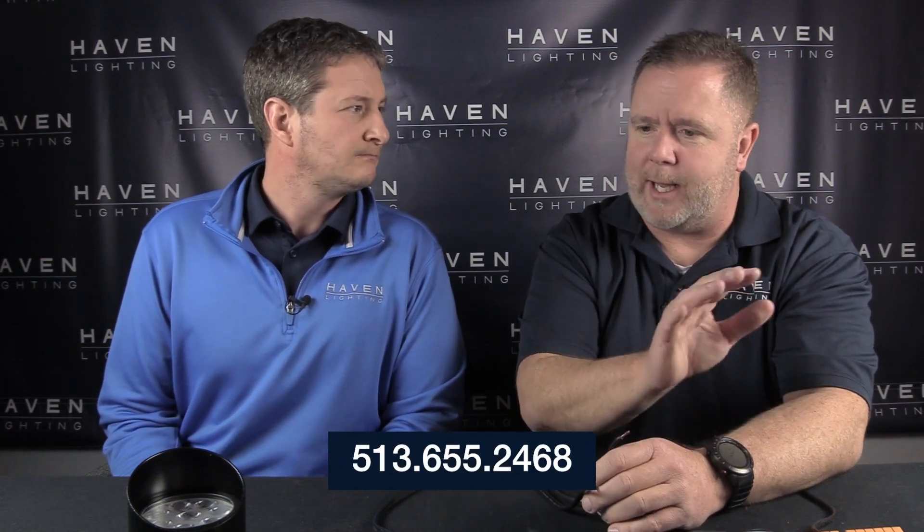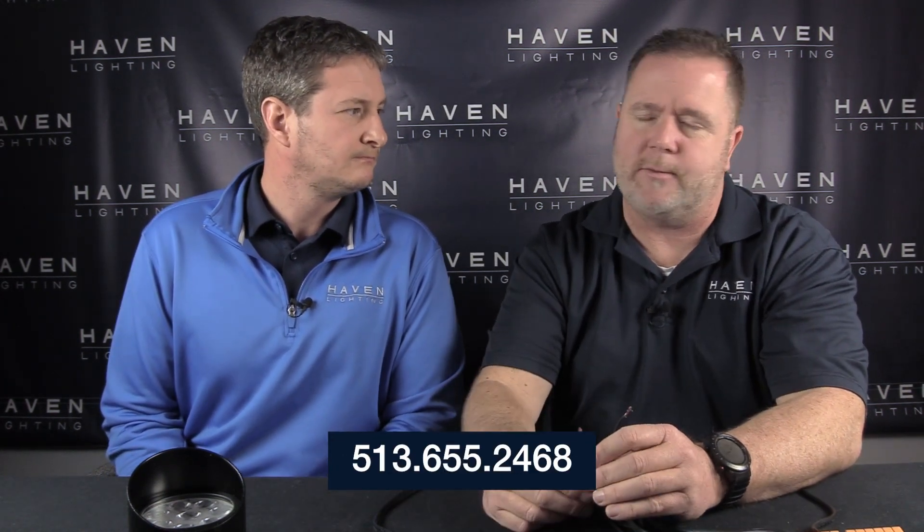The other thing to keep in mind when wiring your system is that, like most transformers, we recommend using 80% of the transformer's full capacity. Our transformers are oversized so you can go a little above that in certain situations, but as a general rule of thumb, 80% is your number.